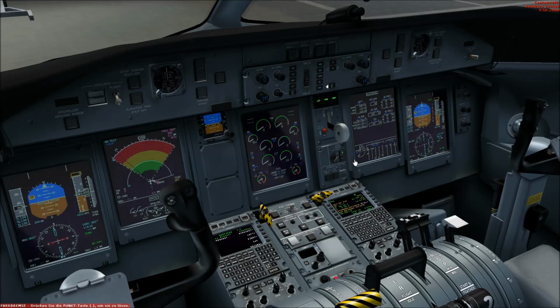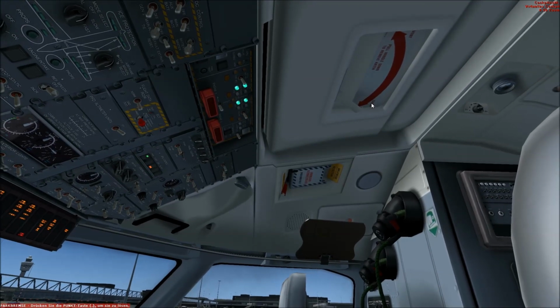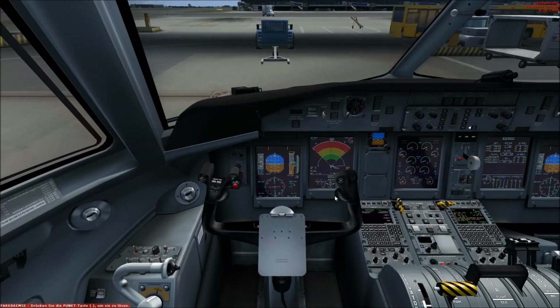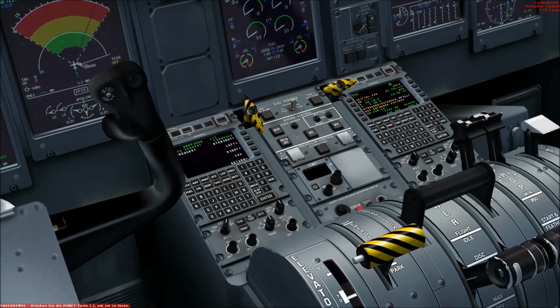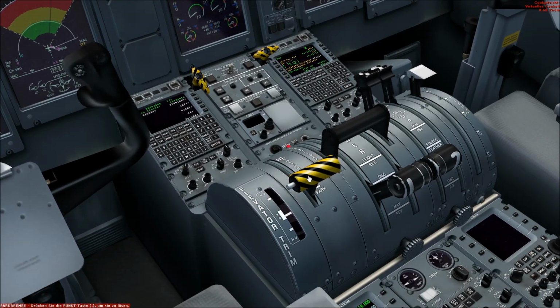Now the next step is the before start checklist. External power APU voltage is on and checked, circuit breakers are checked, escape hatch here at the top is closed, nose steering is set to off. Flight guidance control panel is set, I think it's this one here. Then the next step is the fuel quantity. Yeah, as requested is on board. Hydraulic pressure is checked.